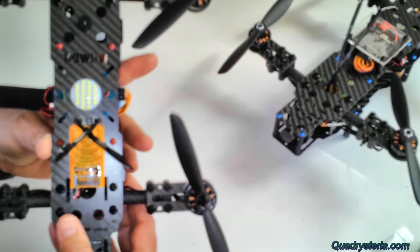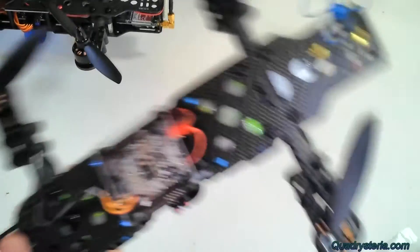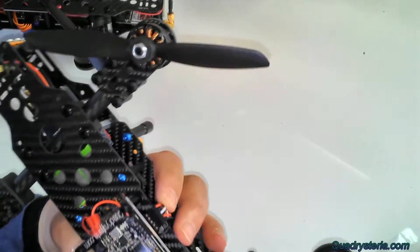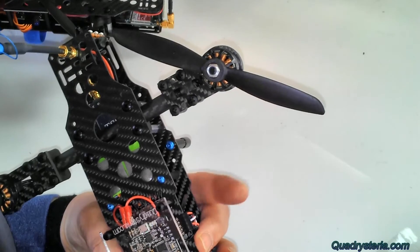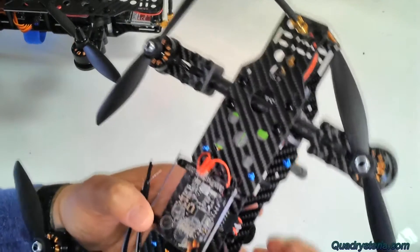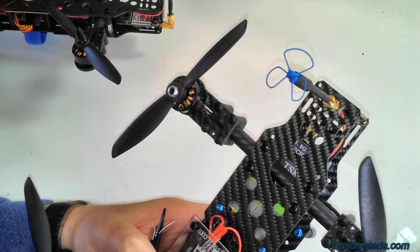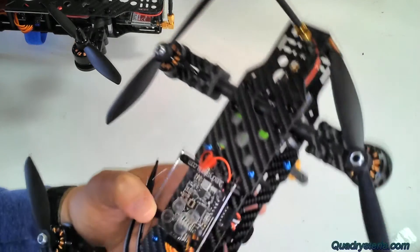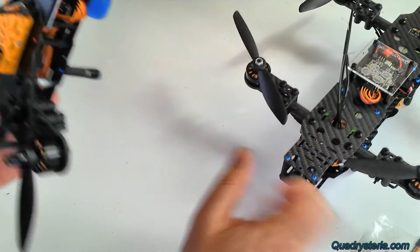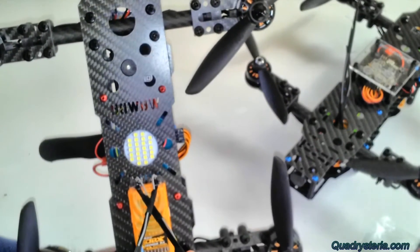The big reason for it is to fly an octo. On the Naze board, you have up to six motor outputs. But when you use a serial receiver like CPPM or SBUS, it enables motors seven and eight over on the receiver pins. So that's really my motivation for this, and I was able to test it — it works awesome. But look at how bulky the receiver is. We've got an eight-channel receiver with one wire coming out of it.